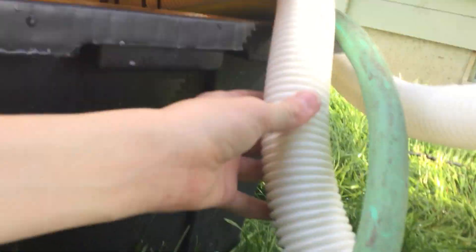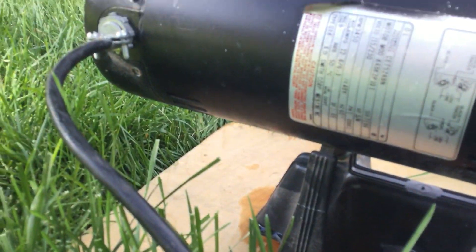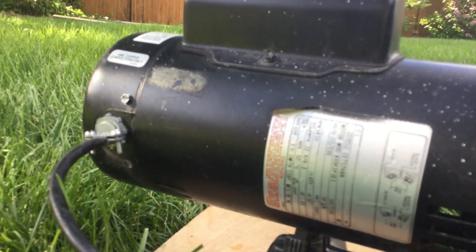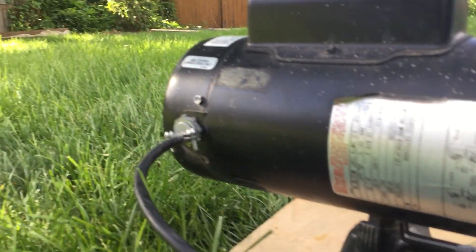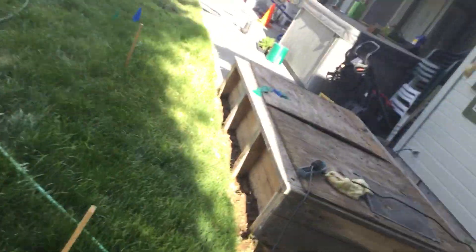This is the suction on this hose, discharge up here. This is configured for 115 volts, 3450 RPM pump, and it draws 12.6 amps from the mains. I got that all wired up in here and put a nice long cord on it.